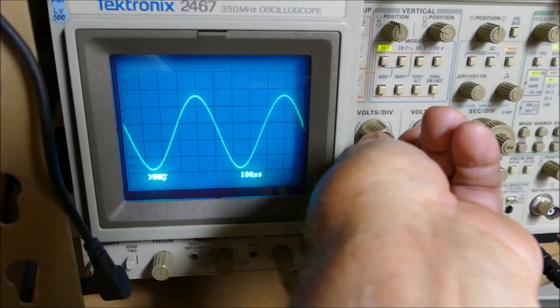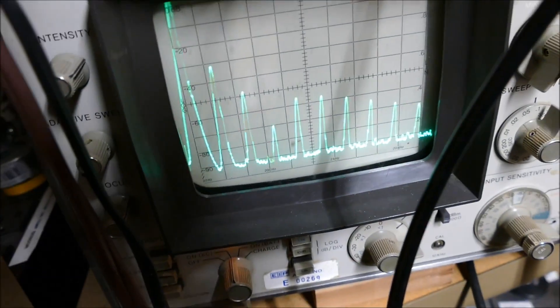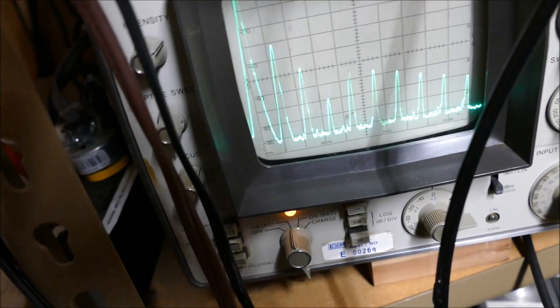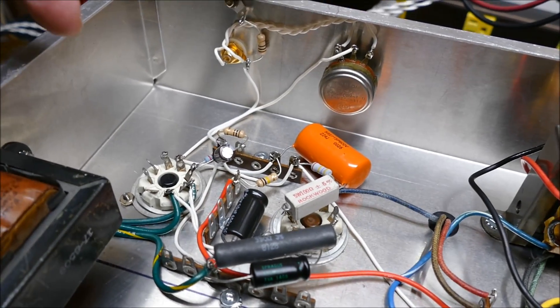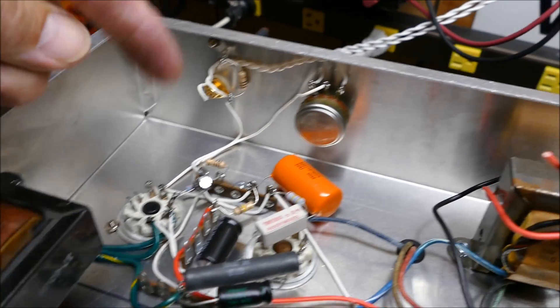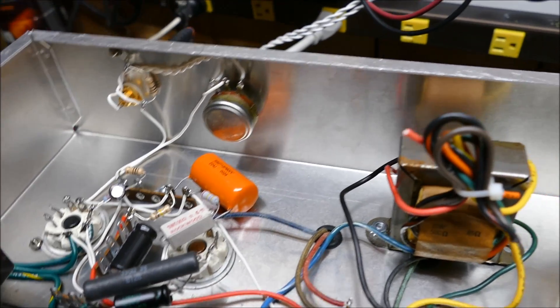Let's see what this looks like. I'm going to crank this thing down a little bit. There we go — that looks pretty good. There's the harmonics, sure singing out there: fundamental, 2nd, 3rd, 4th harmonics down for whatever reason. So that's the driver section. I'm going to leave it like it is. This is one section of a 6SN7 and a 6V6, cathode biased. Pretty simple.